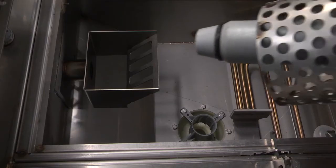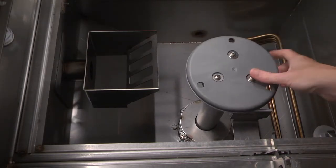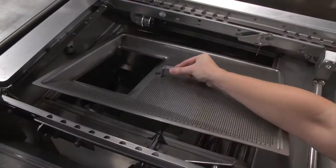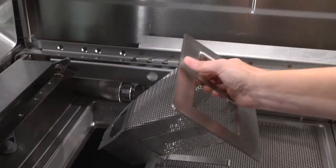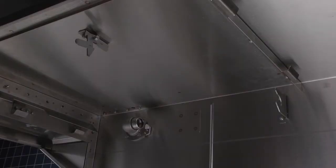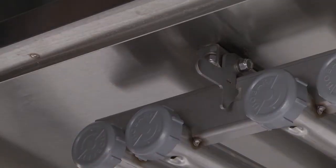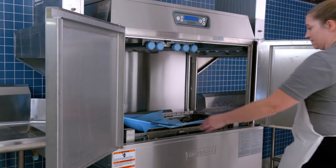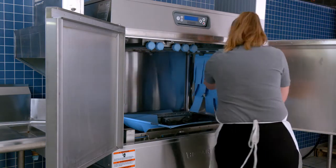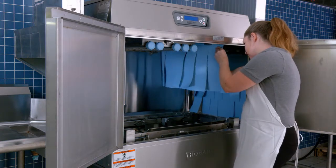Make sure that the dishwasher is clean and that all parts are in place. Install the standpipe and integrated pump intake screen in the wash tank. Install the slanted strainer pans and lower the deep collection bucket. Install the upper wash arm and the lower wash arm with all end caps. Hang all curtains according to the appropriate curtain diagram in the operator's manual. Close all doors to lower the drain standpipe and integrated pump intake screen.